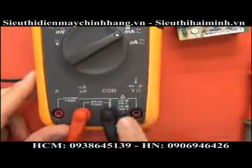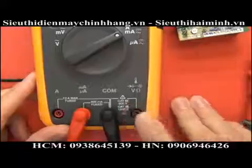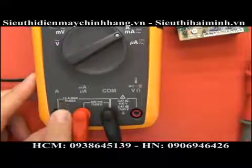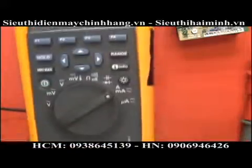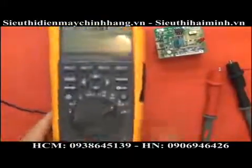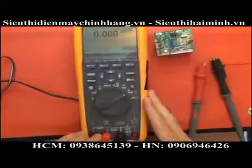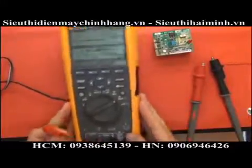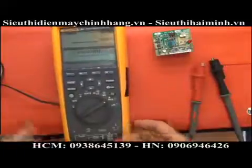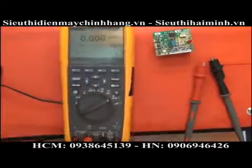One thing I wanted to highlight is that this multimeter certainly has the right certification and safety category ratings — it's rated to CAT IV 600 volts and CAT III 1000 volts, and it's fused on its milliamp and 10-amp ranges. It also uses optical sensors inside the banana jacks — so if you're on the current range and trying to measure voltage, it will warn you that the leads aren't connected correctly. That optical pickup confirms when you're plugged in correctly.